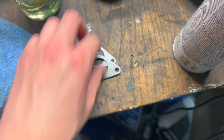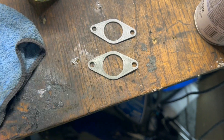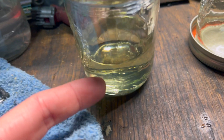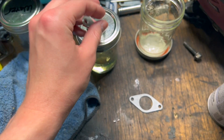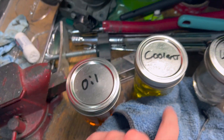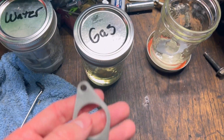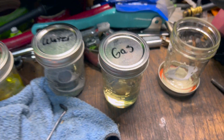Whereas the control still feels rigid — I can't compress that as easily, whereas this one it's just immediate. You can kind of see there is a little bit of difference in color; this one looks a little bit more yellow, which is probably just from the gas as well. You can definitely tell that this has absorbed some. Maybe don't make a TPU gasket for something that will be coming into contact with gas. But as from what I can tell so far: the oil — perfectly fine. Coolant — perfectly fine. Water — perfectly fine. And then air, obviously, that's just the control. I think I'll make an update video once a month has come up. But this is just after 10 days — my 10-day little experiment.